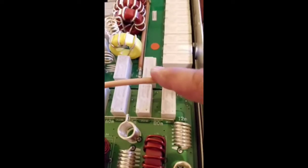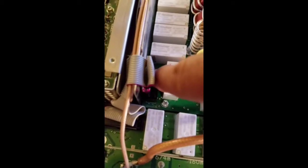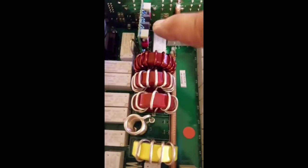The coax cable comes up a bit — it's high-quality braid, but you don't want real hard curves in it. Just inspect to be sure there aren't any sharp curves and that there's enough clearance away from the nearby coils. At this point, go ahead and screw down each one of the screws at each corner to make sure that's a good solid connection. Then just make sure that each one of the dual inline pin plugs and ribbon connectors are seated properly. Check the other plugs as well. At this point we'll put the cover on — this is a ground for the cover, and this is a secondary ground for the cover that was originally used. Should be good to go, and we're ready to test it.